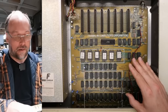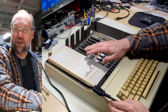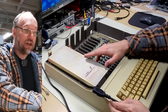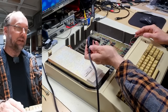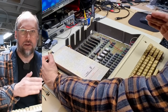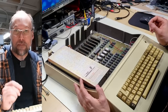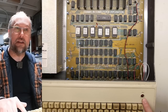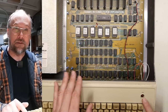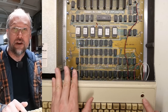In the case of this computer, we don't even know if it's a problem with the motherboard, because it seems like there's a fault in the power supply. I mentioned in the intro that the machine's not powering on, and I really believe it's simply a fault inside the power supply. First thing we need to do is plug this into the mains and see what happens. There is fan noise coming from the computer, but no other signs of life — there's no beep and the power LED on the keyboard doesn't illuminate.